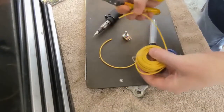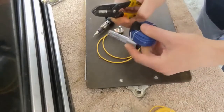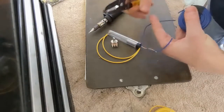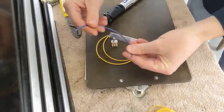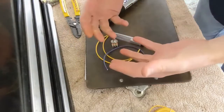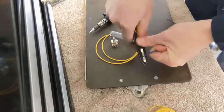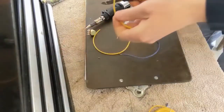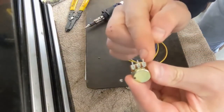I'm going to use two yellow wires and one blue, because we're going to use all three pins. The two yellows will go on my outside pins — that's the full potential 10k. The blue will be my middle pin, and that'll allow me to sweep from zero to 10k. Having different wire colors helps me differentiate, so it makes putting things together when diagnosing that much easier. Strip a little off each wire and solder them on, one to each terminal.